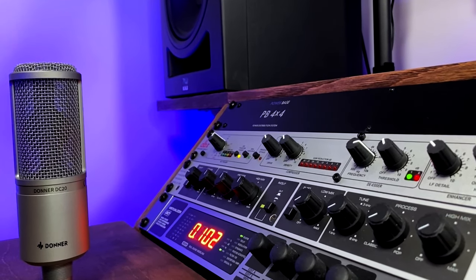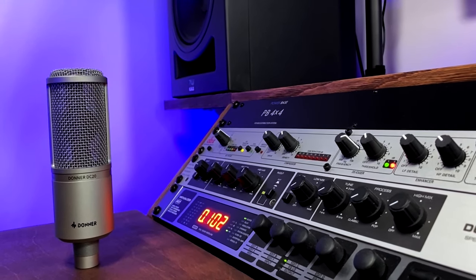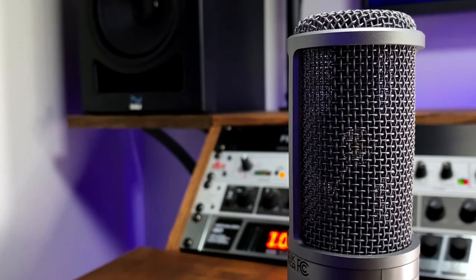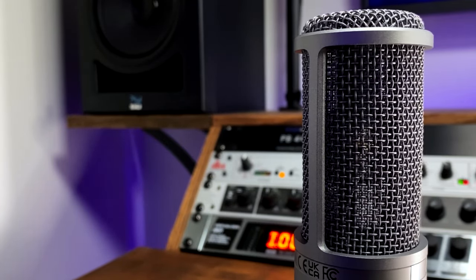Other than that, it is a cardioid polar pattern. You can see here from the polar response chart that it does mainly pick up from the front of the microphone. Now, obviously, this is a condenser microphone, so it's going to require 48 volt phantom power. The other key feature that we want to look at, though, and it's really cool that they include this, is the frequency response chart. Now, according to this chart, it looks like it has a little bit of a dip around 50 to 100 hertz, which is not bad. That's actually normally where you would dip it out anyway. In fact, you would probably shave off a lot of that with a high pass filter. But then it also has a little bit of a bump between 6 to 7K, and then it kind of rolls off around 19 kilohertz. So if this is accurate, that's actually a really good EQ plot to have on a microphone.